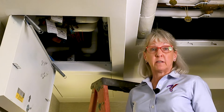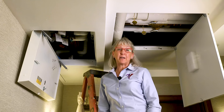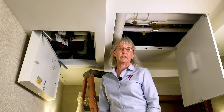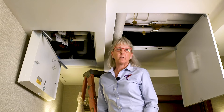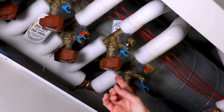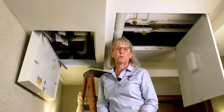Similarly, in large domestic hot water systems, you'll also find balancing valves. These are located in the hot water recirculation pipes and they also need to be exercised regularly. Balancing valves are very susceptible to clogging because they have very small pieces and parts internally which will collect scale and debris. A clogged balancing valve will result in waiting a long time for hot water to be delivered to different fixtures served by the system. When exercising balancing valves, it's very important to understand that they are set at a certain position, and those are typically marked on the head of the balancing valve. You need to know what position they're at before you exercise them, because at the end of opening and closing them a few times, you want to make sure you put them back exactly where you found them.